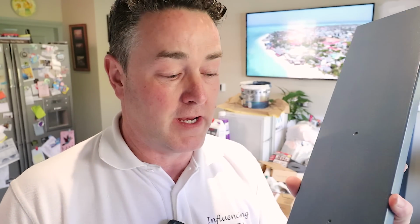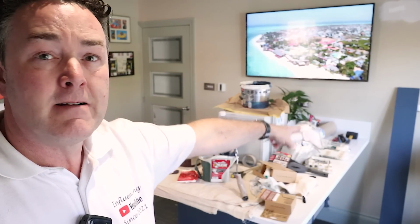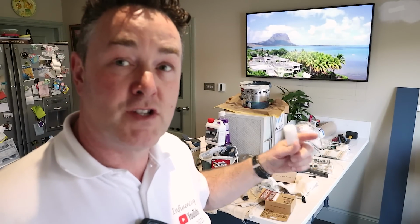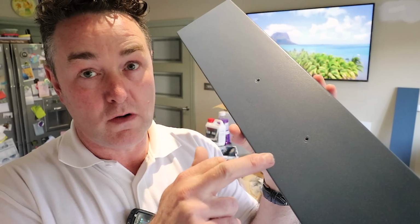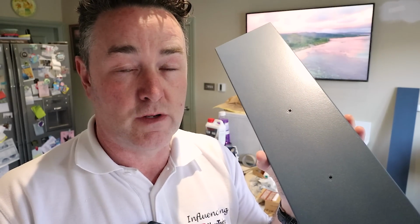So what I'm going to do is finish the day out today doing all my base units under here, some kickboards, the stuff that I did yesterday, and I'm going to go and try the 5mm. Now if the 5mm is pants and I don't feel I'm putting enough paint on, I'll drop back down to a brand new 10mm and start again. But I'm hoping that mottled see-through look of this dark Stiffkey Blue goes with a second coat.